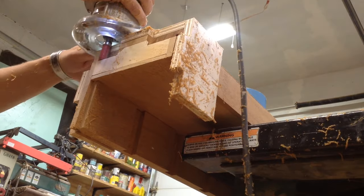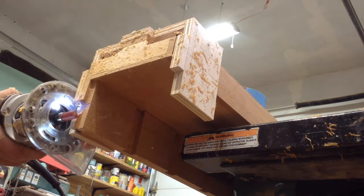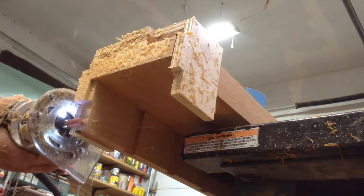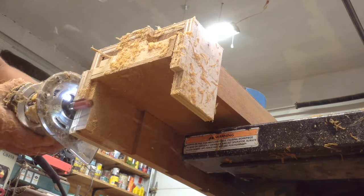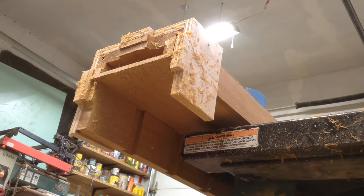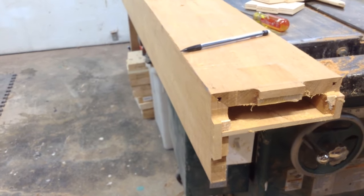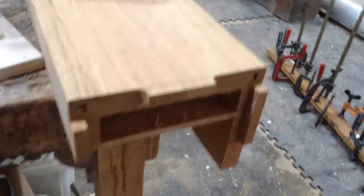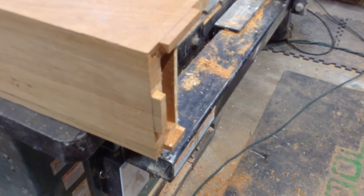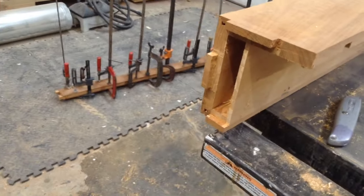Of course, where I cut this it went right through one of my plywood pieces in the center, so I had to take that out because it was in the way — the cornice has to go all the way down. I could just rotate the router and pop out that plywood. In order to remove the rest, I flipped the jig around so the teeth were facing the other way and used the router to remove the excess. My camera cut out while I was doing that, but that's basically what it looks like once everything's done — three-eighths inch little teeth on the top.